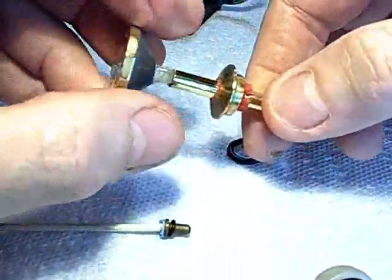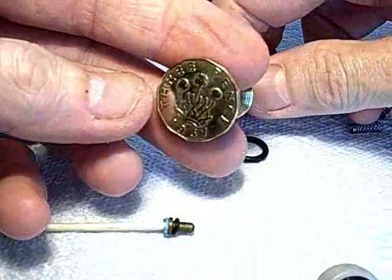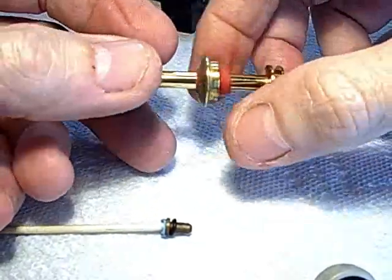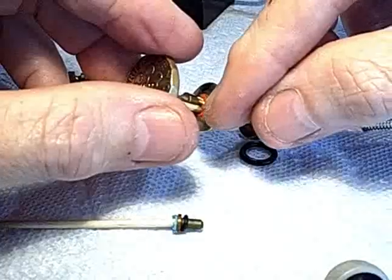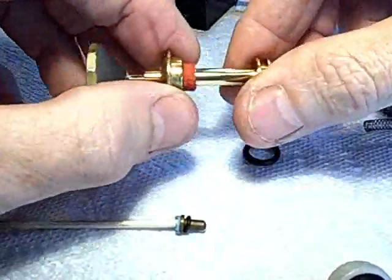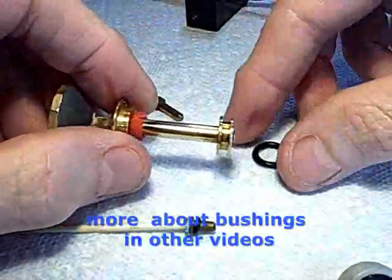Two modifications. I got rid of the rocking lever pump mechanism. A direct action is better. For a handle, I chose an old coin. Put it on with epoxy putty. And just tonight, this is one reason I took this apart, this plunger would rattle in the shake of that hole. So I reamed the hole oversized and I lined it with red bushing cloth. So this will work without any extra lubrication needed, nice and smooth. It'll stop that little rattle that I'd get at certain speeds.